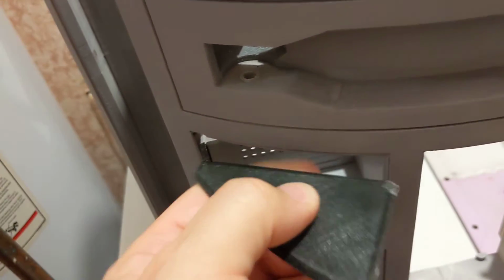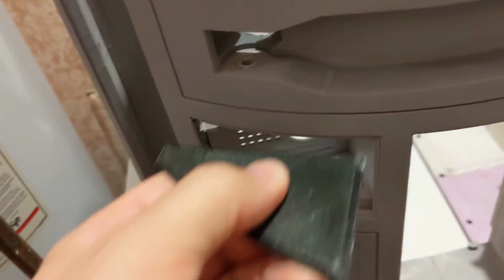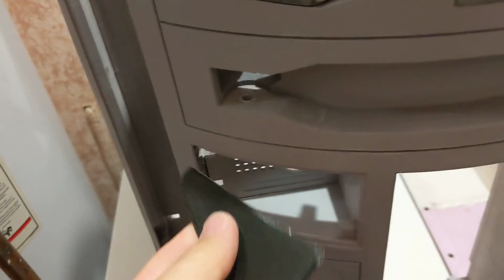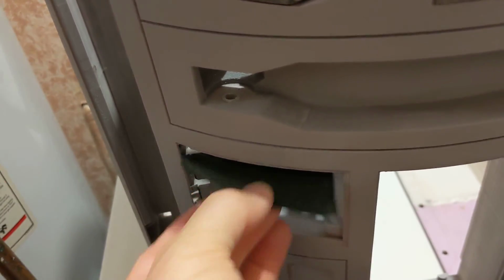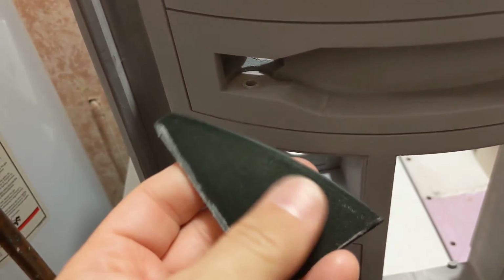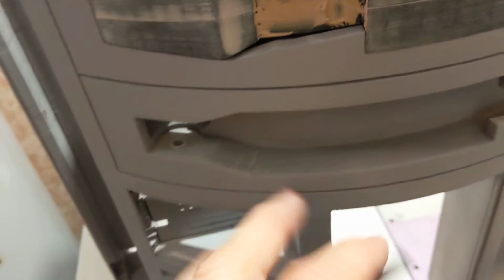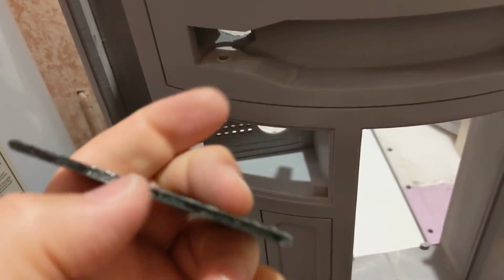But if you paint that white before you put the arms in, you have to take this out to get the arms in. So the arms need to be painted blue and the droid white, and then put the arms in, and then this panel goes in last. So this piece pretty much should be sanded, filled, painted white on its own, and then body white, get your arms done, and then once that lower arm is done and installed, then you can take this, and like I said, probably hot glue would be better than gluing it like I did with plastic glue